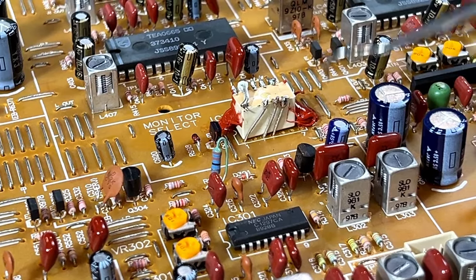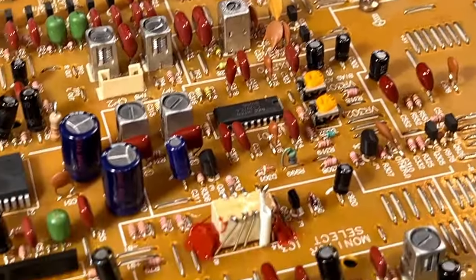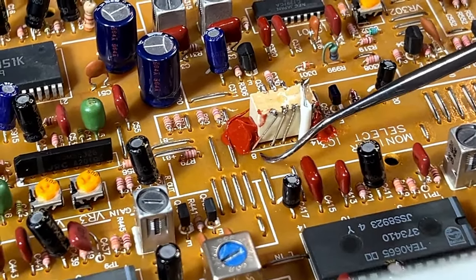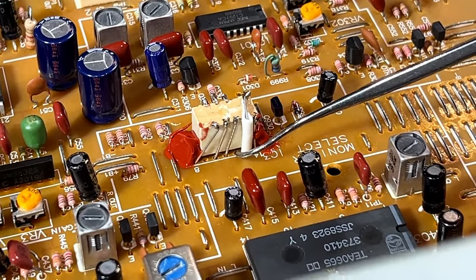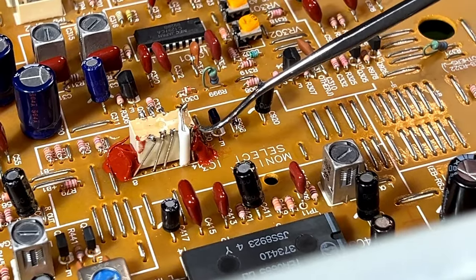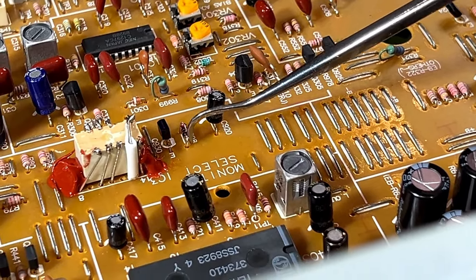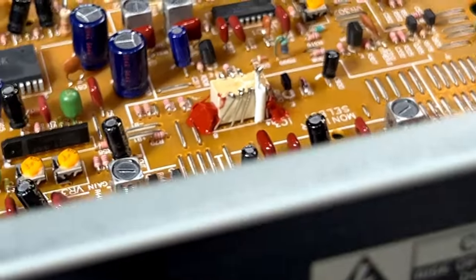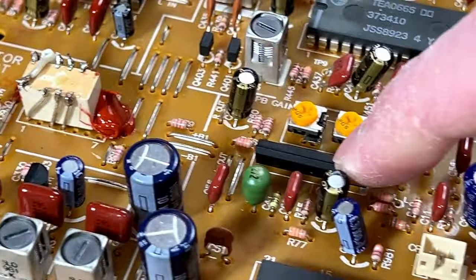These are the three pins on this side, and I'll show you what's going on the other side. Yeah, right there, you've actually got five pins connected on this side. So you skip pin 9. Pin 9 and 12 don't have a connection. Pin 13 goes up here and over to this lead. Pin 14 comes up here to this lead. These are what's driving the coil, and then here's the diode right here to make sure that the coil gets the right voltage in the right polarity. So, that's about it, I think. There's the new IC number 2.